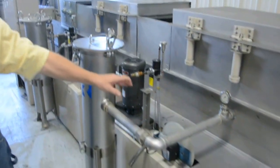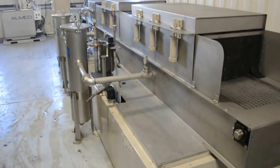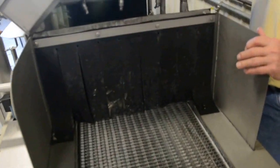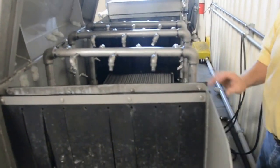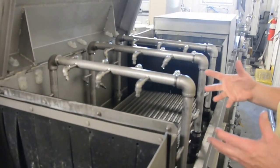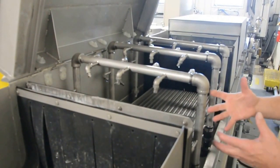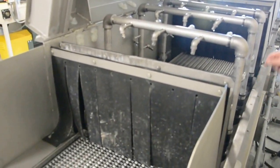Oil wheel, settling tank. The wash tank is also a very typical set-up with three manifolds and six individual spray units. This is 360 degrees, so the part is washed from bottom, side, and top six times as it goes through the wash.